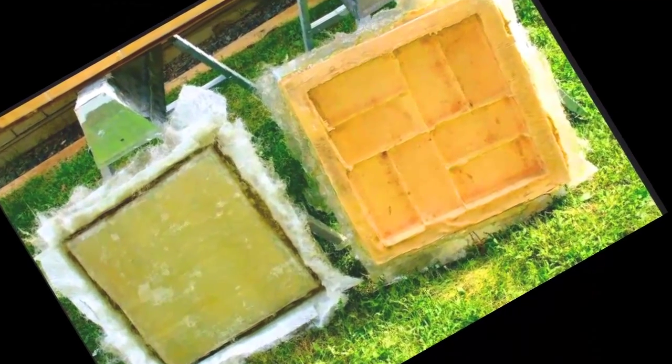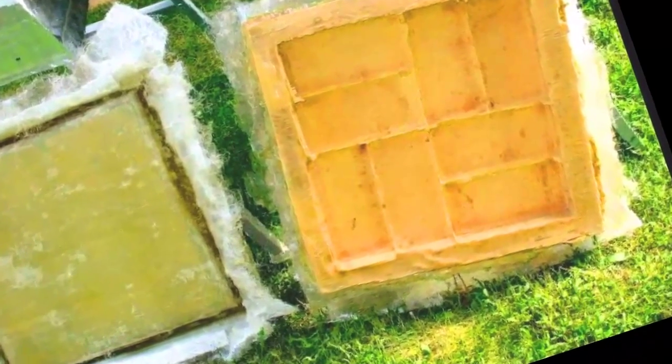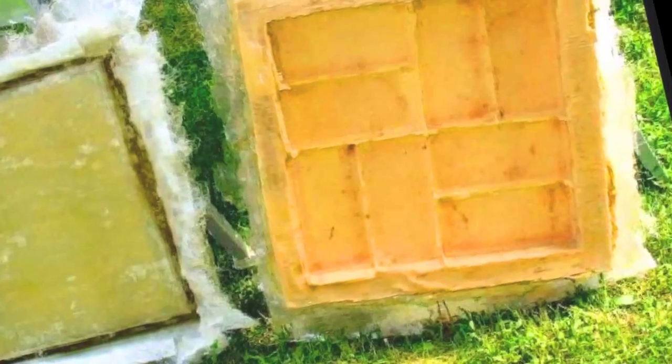This is the first coat of fiberglass mat and resin waiting to dry. The resin doesn't completely dry in this step. It remains tacky, which helps in the application of the next layer of matting and resin. And I'll put on 3 layers in the shell mold to give it strength to stand up to the repeated pourings of concrete. Once the fiberglass is completely dry, I demold it using a small pry bar that I worked around the edges. The fiberglass shell came free without difficulty because of the mold release.